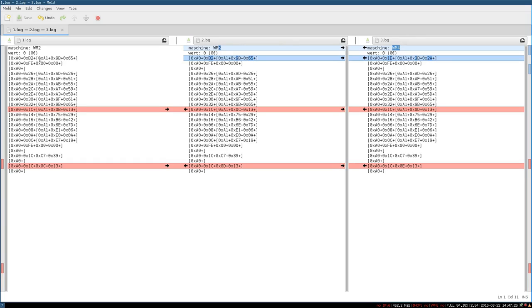Now, this is how the Bus Pirate represents the communication. The open bracket means there is a start condition. Then we have the 7 bits, or the 8 bits of the address, which tells you if it wants to read or write. Writing is a 0 at the end, and reading is a 1 at the end. Here it asks for writing. This plus is an ACK. After the ACK, there are again 8 bits, which are ACKed, and then there is a second start bit, meaning it's another transaction.